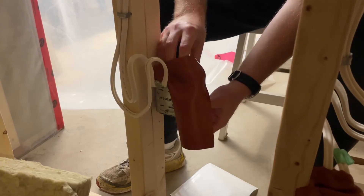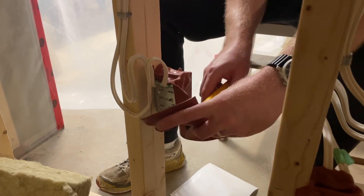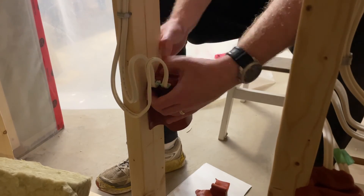In terms of sound isolation, I installed standard electrical boxes, which means you have a fairly large hole through the drywall at each receptacle. I wrapped each box in a putty pad for air sealing, and you can also use caulking around the edge once drywall is installed.